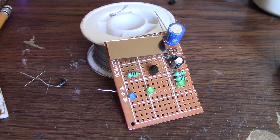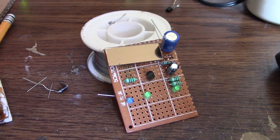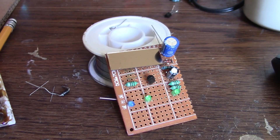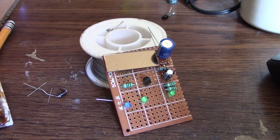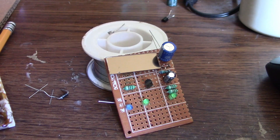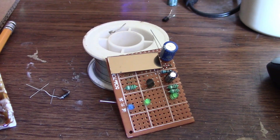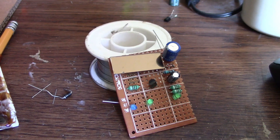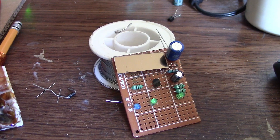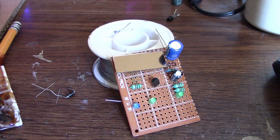The next thing has been to swap out the 1N4007 diode for a blue LED, and it's changed its operating again. If I cover over, you can see it comes on for a short while - presumably draining the 10µF capacitor. We're getting a flash now, and that's with my hand slightly away from the circuit. It seems to come on and then go off, but just there as you saw there was a flash.